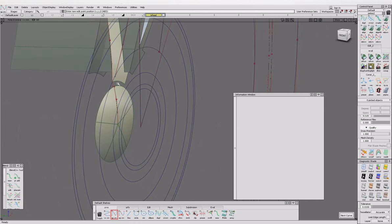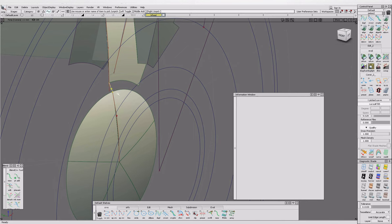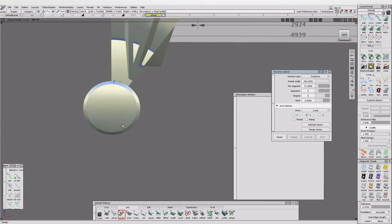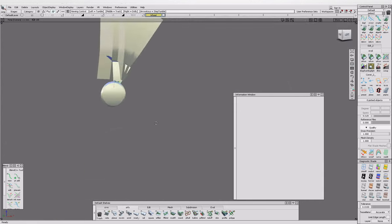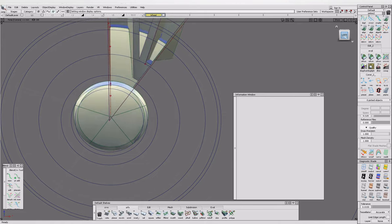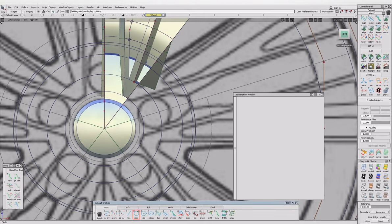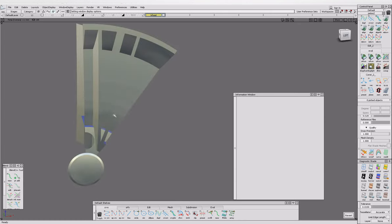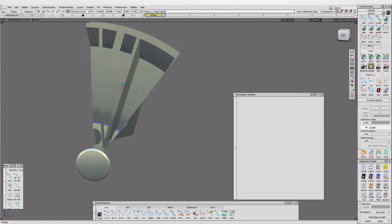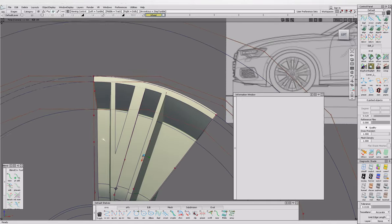And then build the border. One, two. Make sure that's in the center. And revolve. And again, template the bits we don't need. I mean, we can keep that there for now, actually. It's just the badge, isn't it? Okay, and then we can also put in the circles for the bolts, where they're going to trim away. Discard. There you go. So we have most of the wheel now in. Save your work, and let's get these filled in here, and then we'll start adding radiuses, like the important ones.